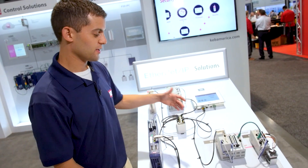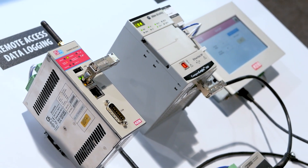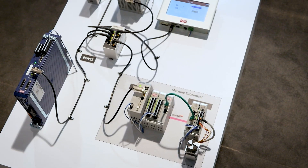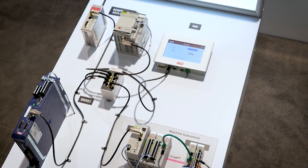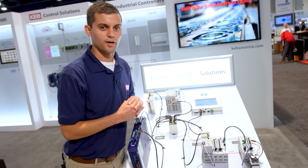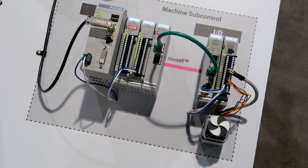Another feature of the C6 Smart is that it can also connect to other EtherNet/IP devices in your machine. For example, the C6 Smart is handling all the intense motion here, while the other PLC is just sequencing which motion profiles to run — and it can do that via EtherNet/IP communication. We also have remote I/O modules that act as EtherNet/IP slaves to transmit data back and forth between our devices.